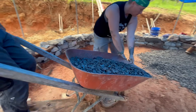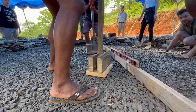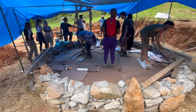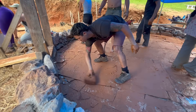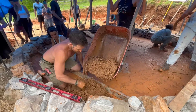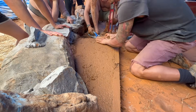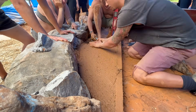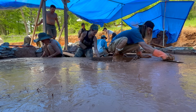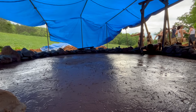With the foundation complete, we were now ready to begin installing our earthen floor. We start by adding a compacted layer of gravel for drainage purposes, and once this is compacted and leveled, we lay our insulation layer using scrap pieces of cardboard. We apply a layer of clay slip to the cardboard, and then begin pouring and leveling our base layer for the earthen floor. For the base layer, we use a mixture of clay, sand, gravel, and straw, and we pour the floor to a depth of about 4 inches, integrating the mix and leveling it out until the base layer is complete.